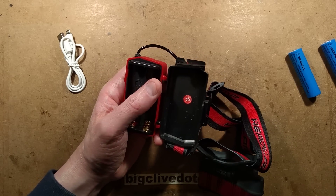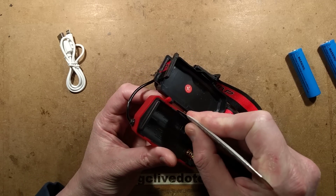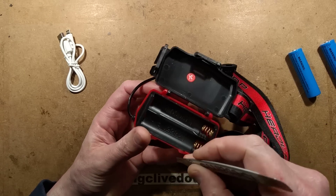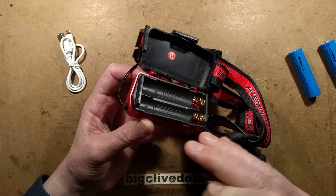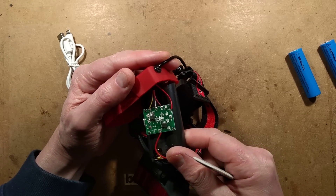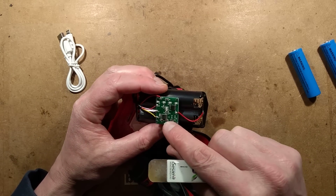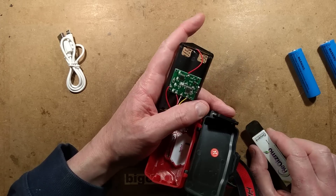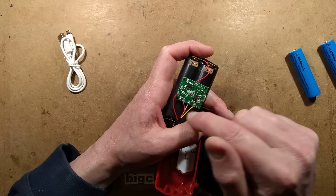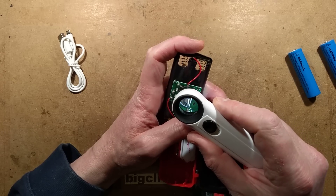Let's open the battery pack. It looks like it clips in here, and I'm expecting a little circuit board central to the back around about the vicinity of the USB charge socket. We've got three wires going up — interesting. Why three wires? Maybe one of those is the signal that it's on, to actually make the LEDs light. This must have a charging chip and then an indicator chip for controlling the LEDs. There's the LEDs — they're all going to that chip. This chip down here is marked 4056A.